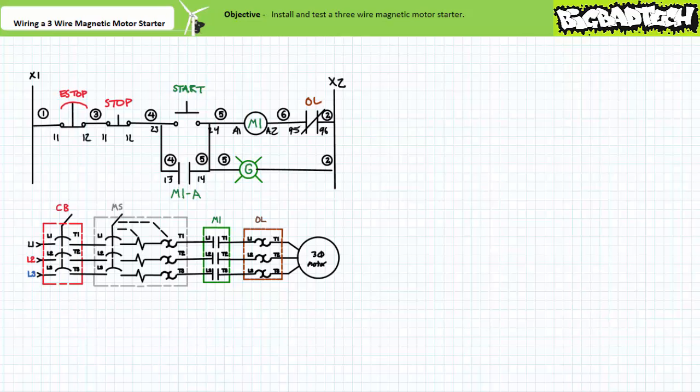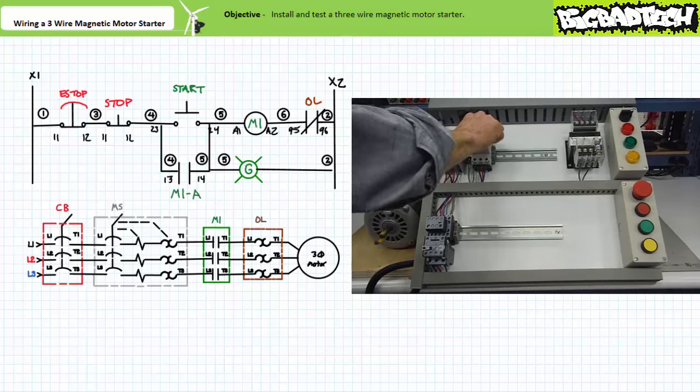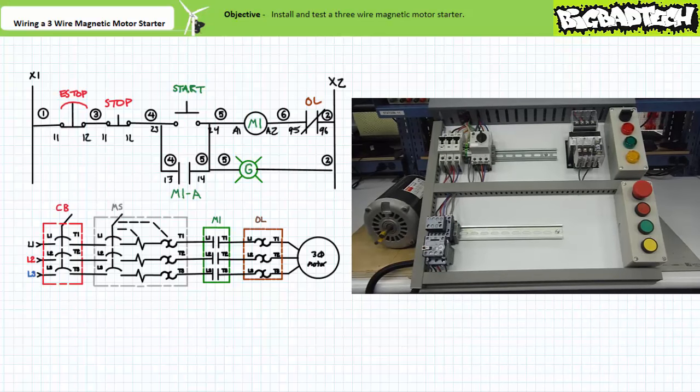This utility offers a level of functional isolation for test and troubleshooting purposes. Now let's include the primary circuit by closing the manual motor starter. When the system is unlocked, plugged in, and both the circuit breaker and manual motor starter are closed, the system initially does a whole lot of nothing — an operator has not initiated the start sequence. When an operator presses and releases start, the pilot light comes on, the contactor physically closes, and the motor rotates in one direction.